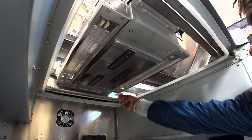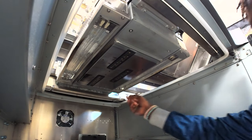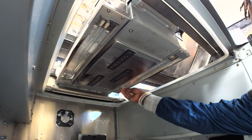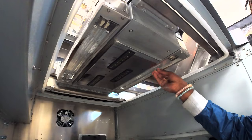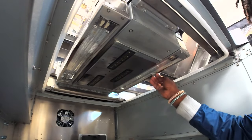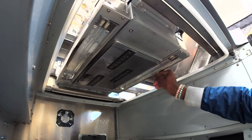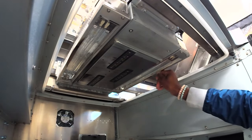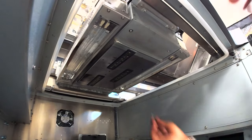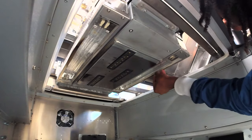Here we are. This is my favorite part. We're going to go underneath the print carriage. We're going to scrape off all the excess dust, all the burnt dust off the glass, before any other build is made. Nice and gently. Take your time with this, and be extremely careful cleaning these.